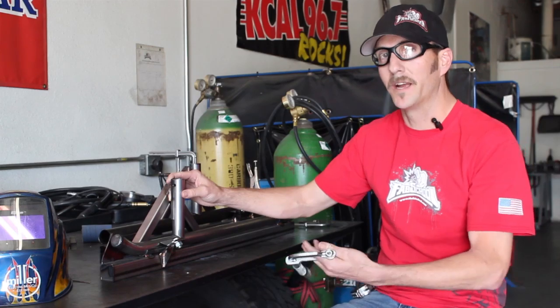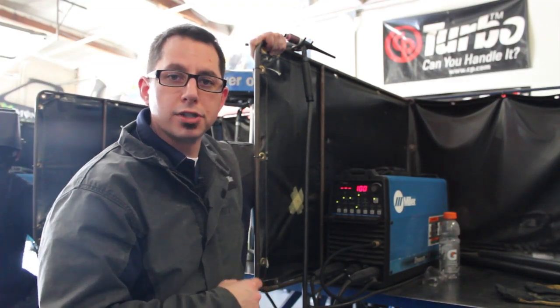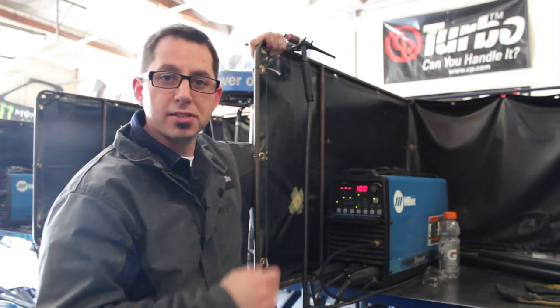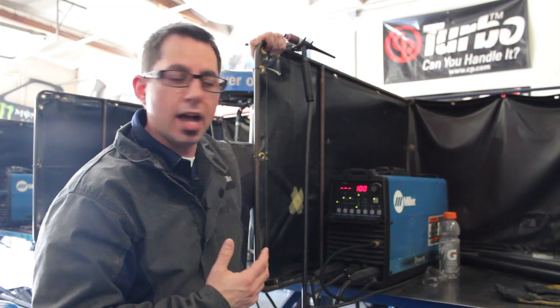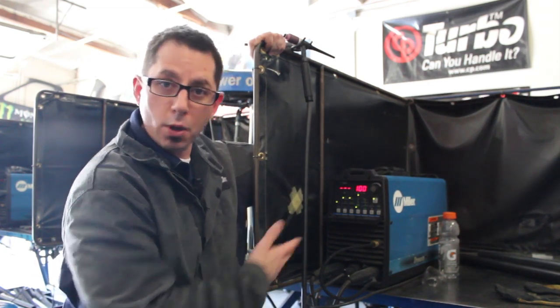From there they will be MIG welded. What we were just looking at is that cap being welded on the end of the nerf bar, just using a fusion weld or an autogenous weld — just melting the two pieces together. It's non-structural, it's more for aesthetic value. Obviously it's going to be really difficult to add material on the outside, so using the Dynasty 200 we capitalized on its pulsing feature.